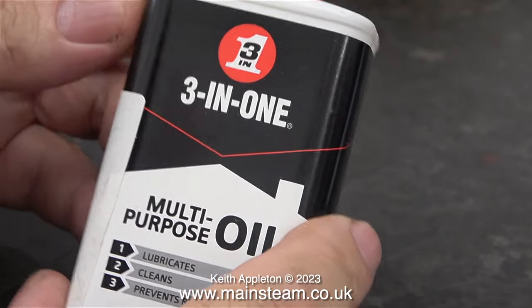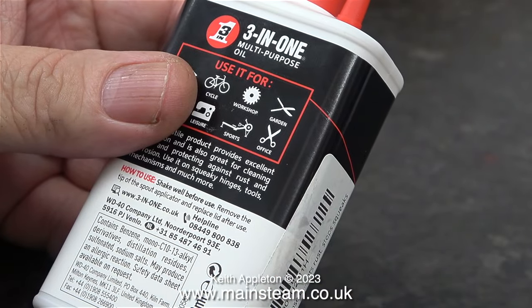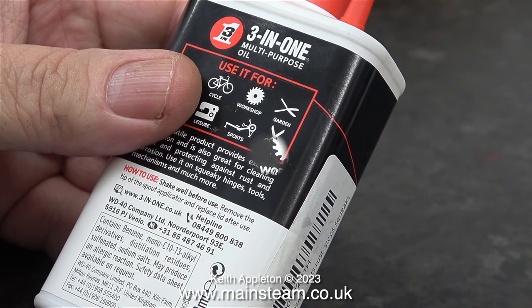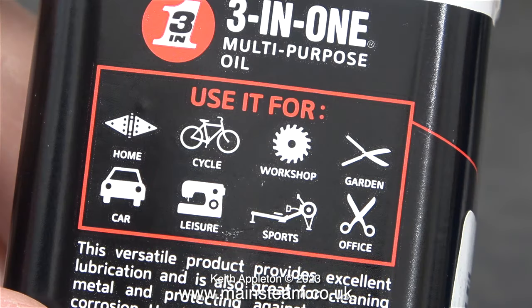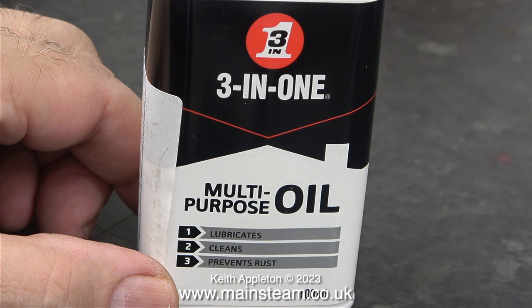This is a bottle of three-in-one oil that I bought to oil my friend's fairground organ, which has a Hammond L102 organ right in the centre of it. The Hammond tone wheel range really do sound good, and the tones are generated by revolving metal wheels in pairs on a geared central shaft, with oiling points that need oil once a year. I always found three-in-one to be perfect for the job. When I was working in the electronics industry repairing and modifying Hammond organs — as well as playing my Hammond organ publicly seven nights a week — I always used three-in-one. The original Hammond generator oil was very good, but later on it wasn't such high grade and smelt more like diesel fuel. From my experience, this stuff is just the right viscosity to soak the felt pads in the generator and travel along the pieces of string to all the bearing points.